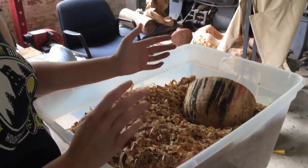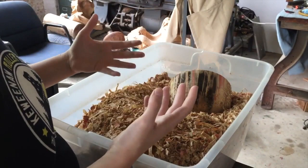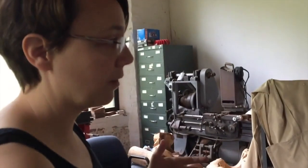Blue stain is a weird category of pigment. Blue stain is something in between a zone line and a pigment, because zone lines are melanin in a very distinct area, and pigments tend to be the things that diffuse through wood, which means that they're being excreted by the fungal hyphae. So the strands of the fungi are actually excreting the pigment. But most blue stains, their melanin is actually within their cell, their hyphal walls. Now, not all of it. Some of them, of course, do excrete the melanin. But a lot of them, it's the hyphae themselves that are blue.